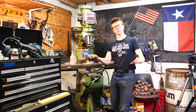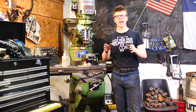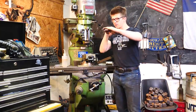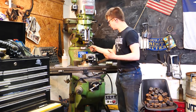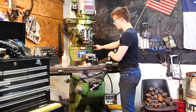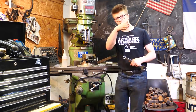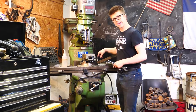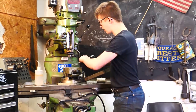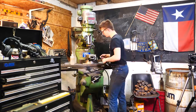Welcome back to normal speed reality. I'm now going to be milling a slot in the long bar so that the piece I just made will go inside the slot for the padlock to attach. I'm going to do this with an end mill, and what I'm going to do is swivel this vise around 90 degrees, tram it in so it's parallel with the Y-axis of my mill, then put that up and mill back and forth to make that little slot.